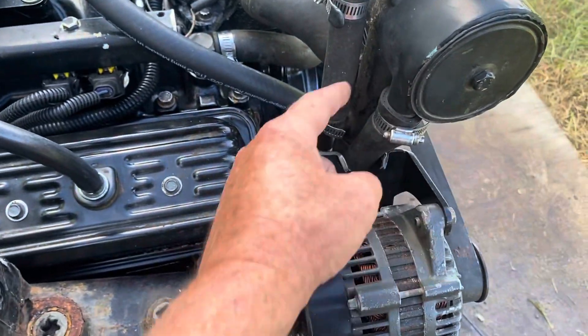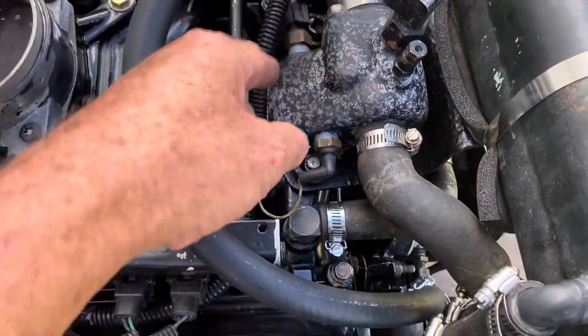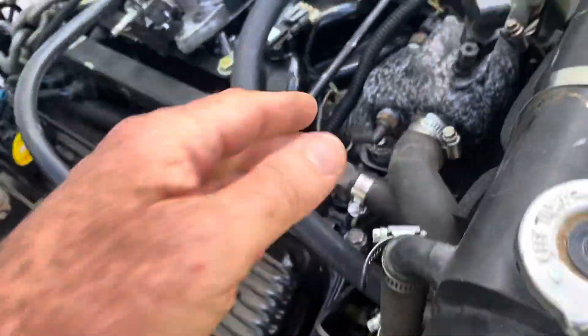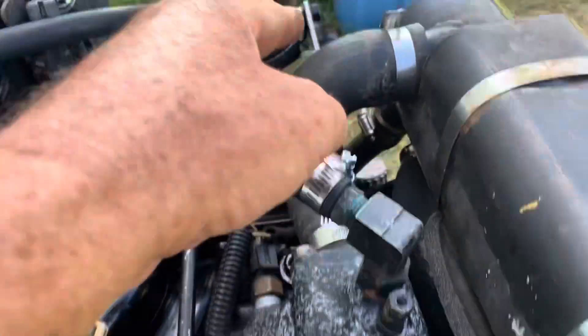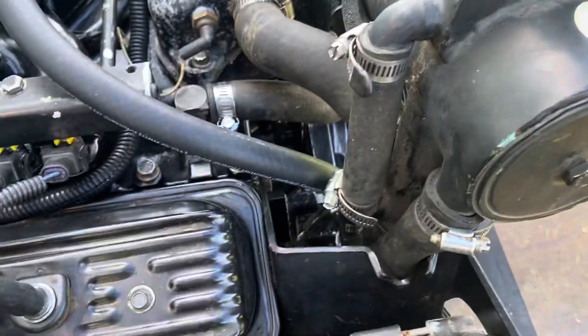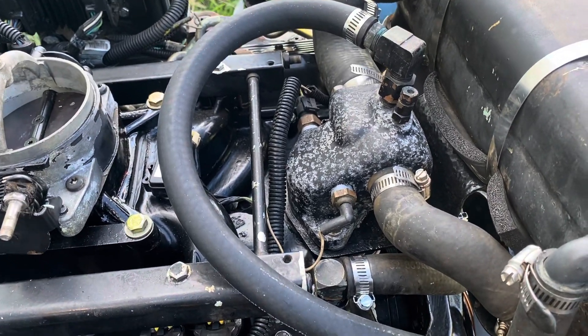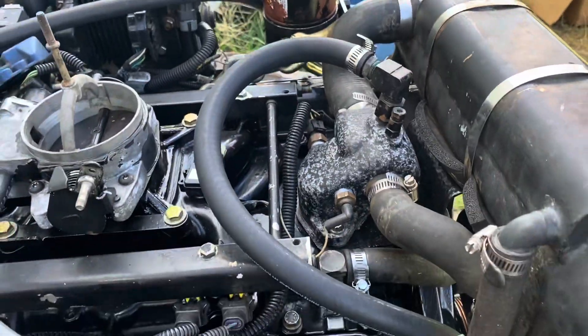Inside this heat exchanger on the engine side, there's a pipe that drops out right here, drops down, goes into the engine water pump. The water pump pumps it through, comes back out here, and your thermostat is right in here. If the thermostat is closed — meaning it's not hot enough — the water comes out, goes through this pipe, and loops right back into the same pipe. Once it gets hot, the thermostat opens and lets it go out into the heat exchanger up here, comes back across, then drops back down out of the heat exchanger and goes back into the engine. The thermostat either directs the water one way or the other, working itself in between to let water go in both directions.